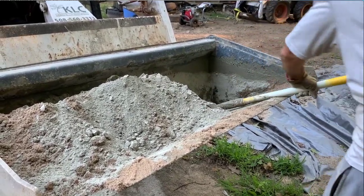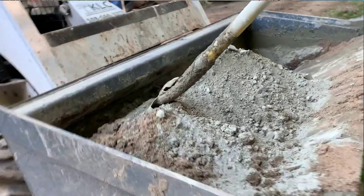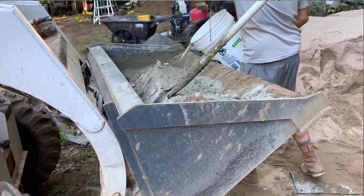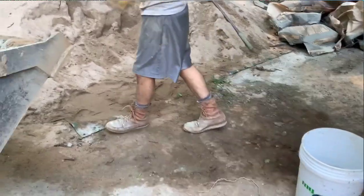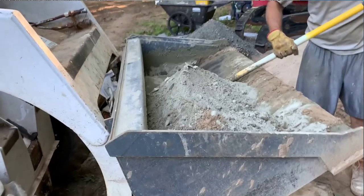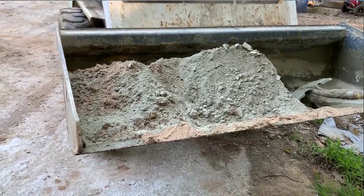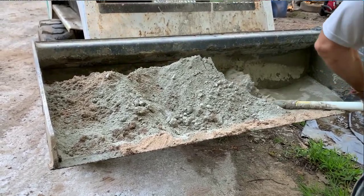When you put in your water, mix your sand and your concrete first and put in your aggregate last, so you can mix this with a little bit more water than you would if you were mixing prepackaged concrete. This way you're able to mix it a little bit looser so when you put in the aggregate it'll suck up a little bit of the moisture. Depending on the moisture content of your sand and aggregate you may need to adjust the amount of water.